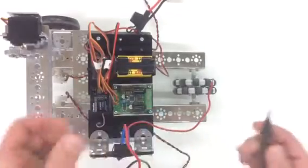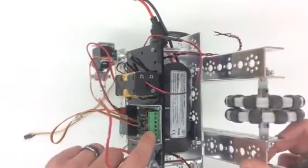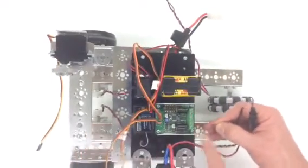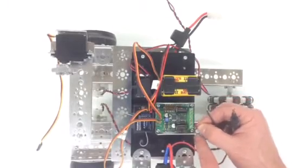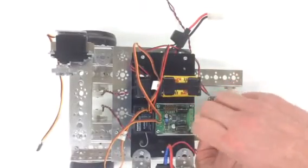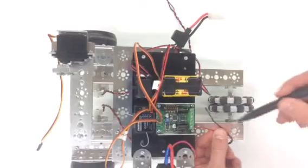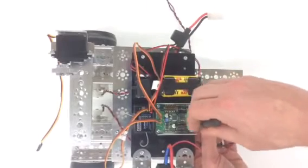You can see there are holes here set up so you can slide the wires into them. I have my DC wires — a black and a red. The red goes on the outside and goes into slot 1A. The holes are a little tight so I need to loosen the small screws inside to get the wire in, then tighten the screw back up — snug but not too tight — so the wire can't come out. Then the black wire goes into 1B.